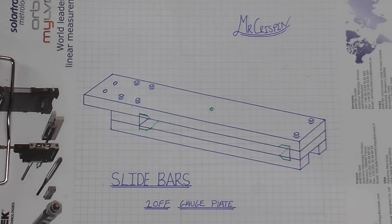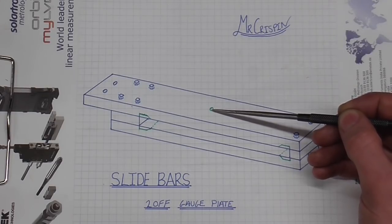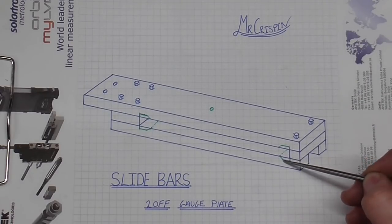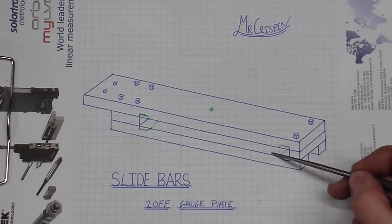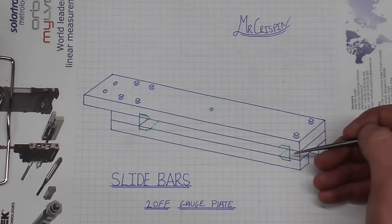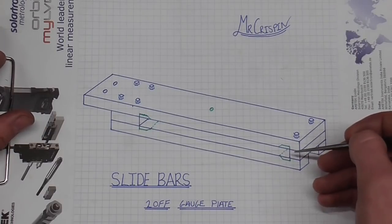The features drawn in green are things I'm holding off on for now. Here you can see an oil hole - I haven't quite decided exactly how I want the lubrication for this slide bar and cross head assembly to work yet. If you have any good ideas on how that could be done, do let me know. You can also see a design feature that I believe to be dirt traps. As the cross head travels back and forth, should any dirt land on the slide rail, it's pushed down, drops over the edge, and falls into this trough - keeping it out of the way. That's a simple but effective design technique and I think it would still work in model size.